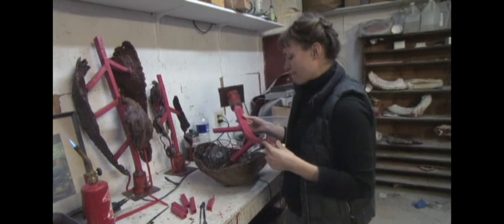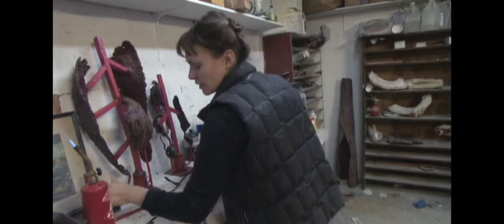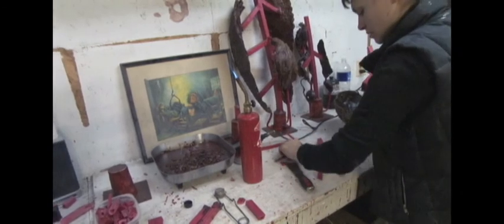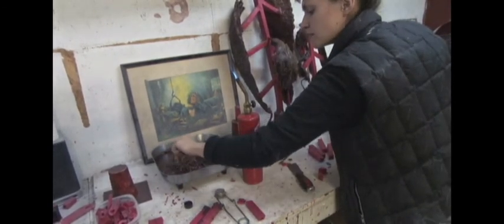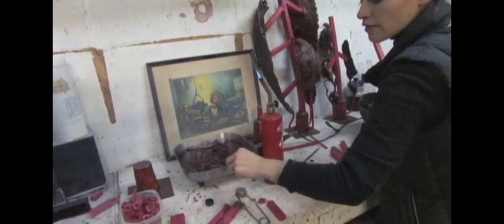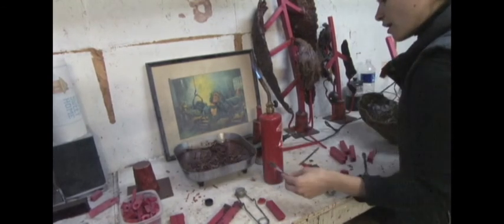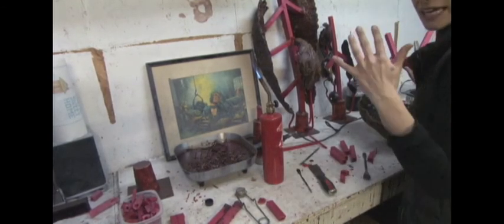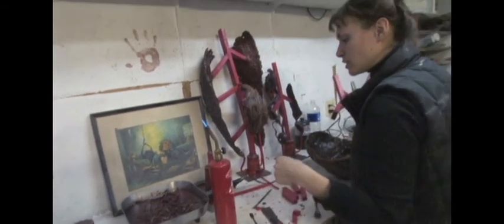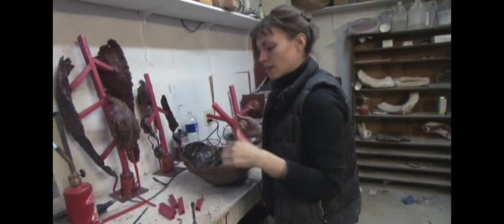As for temperature — to keep the wax at a muddy consistency is around 260 degrees. It's still solid but underneath it's really soft, so you can play with it a little bit. If I need something more substantial, I've got harder and softer in there. It's mostly with a wax welder to heat and weld the existing sprue wax — that's the majority of the work.